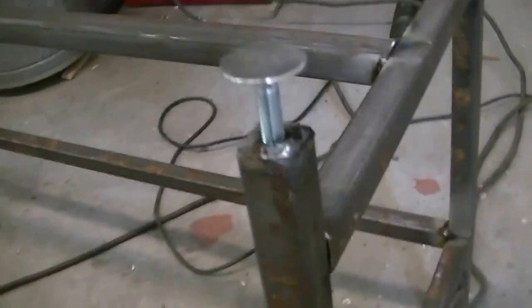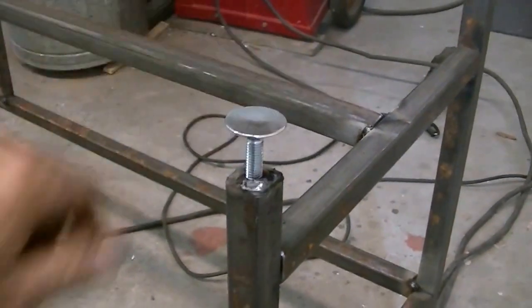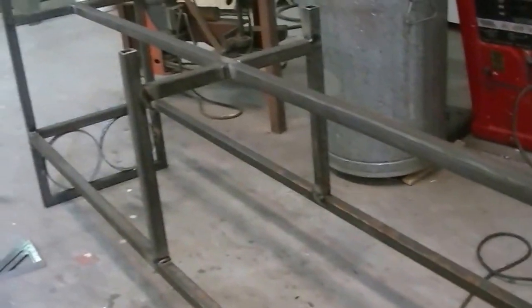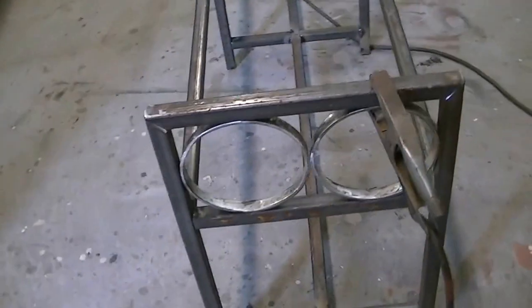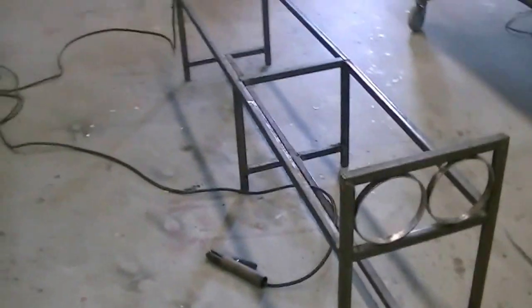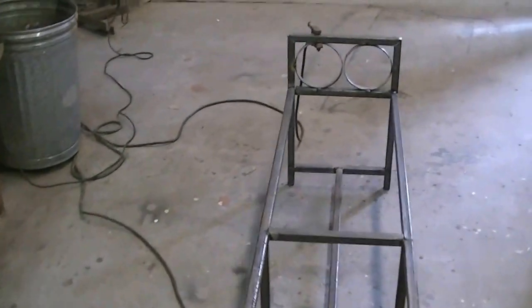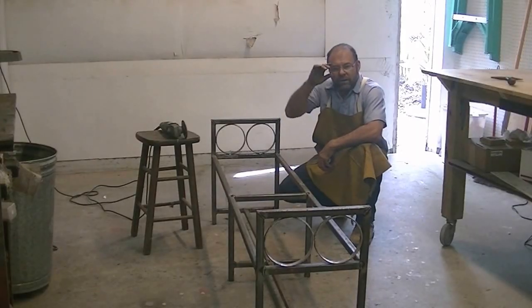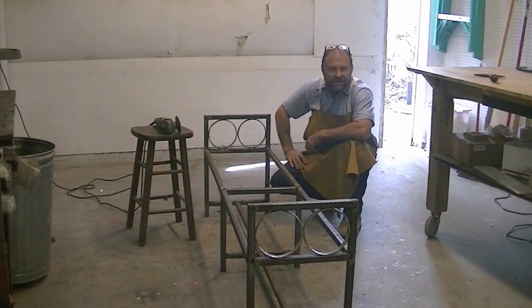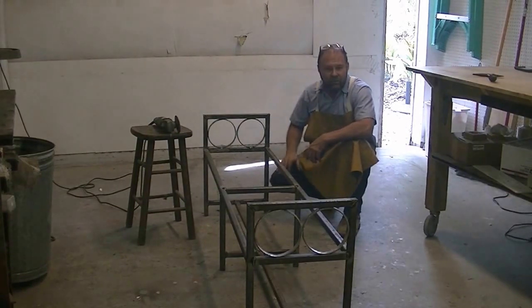For the feet, I've just welded in a nut, and you can just turn and adjust the height. That's it all tacked together. My wife always says how crazy it is — an hour and a half ago that was just two pieces of stick tubing, and now it's a bench. I got it welded up using a 3/32 6011 rod, 60 amps, and I did vertical downhill welding.